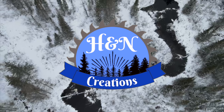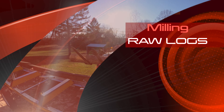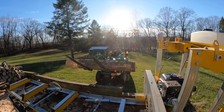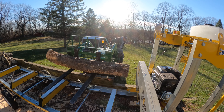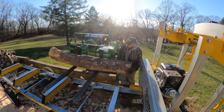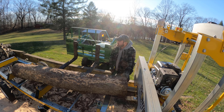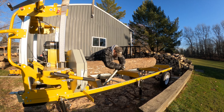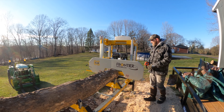So this was mostly to get a bunch of one and a half inch slabs that we'd use for the countertop and the top of the table. The rest of the boards we just cut in one inch slabs so we could use those to build cabinets. We did have a couple larger chunks set aside that we used for the feet of the table, and they had some spots with openings that we filled with epoxy. We'll show those also in the video.